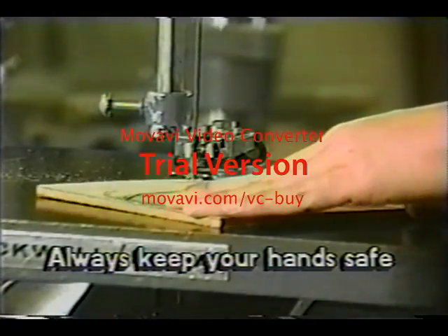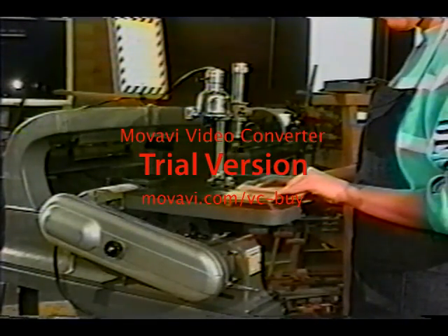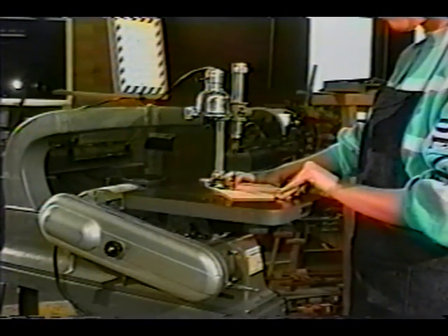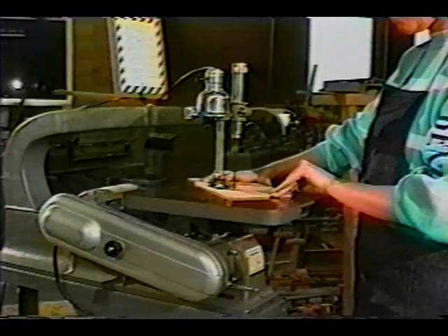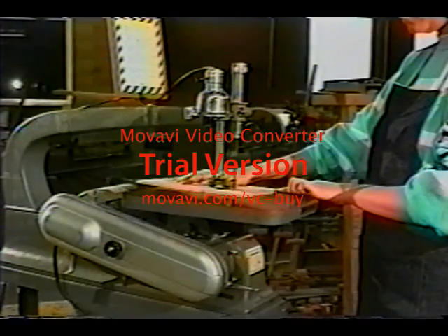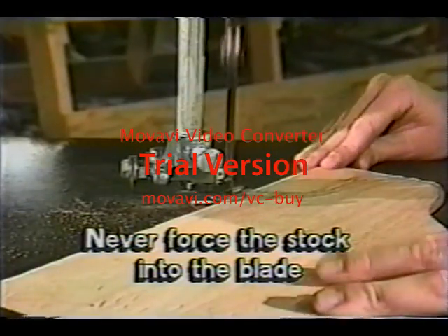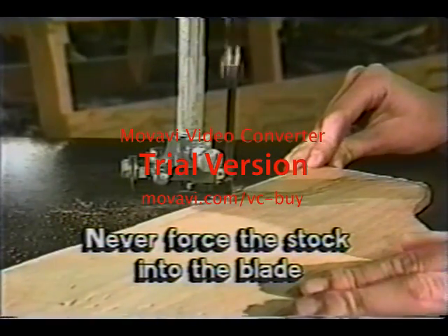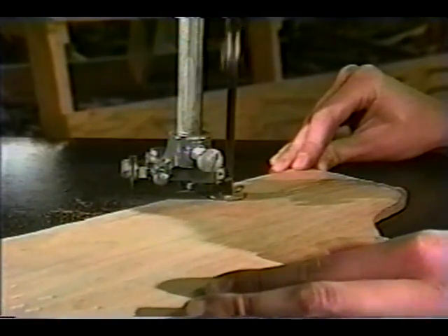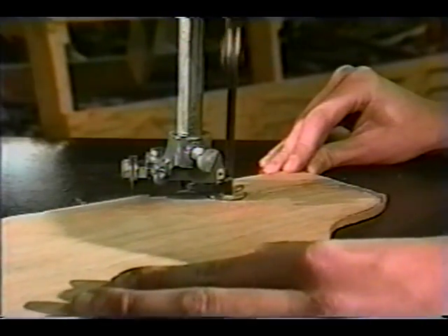Always keep your hands safe. It's very important to keep your fingers in mind at all times. Maintain a generous safety margin between the saw blade and you. Even when cutting curves and intricate lines, keep your hands away from the line marked on the stock. If the pulley is exposed, keep your hands and clothing away from the belt as well. Never force the stock into the blade. Be sure the blade is not in contact with the stock each time you start the saw. Use firm but not forceful pressure. The scroll saw is not supposed to be used for cutting stock over one inch thick — it's designed for light work only.